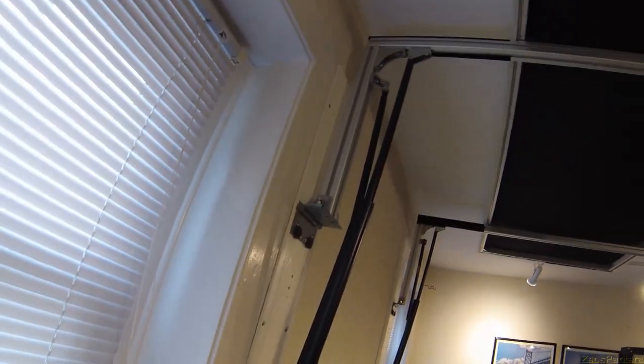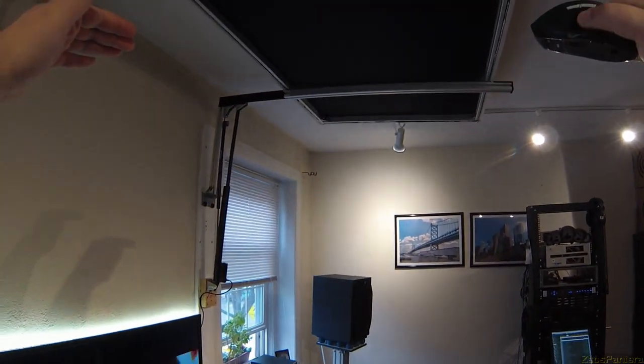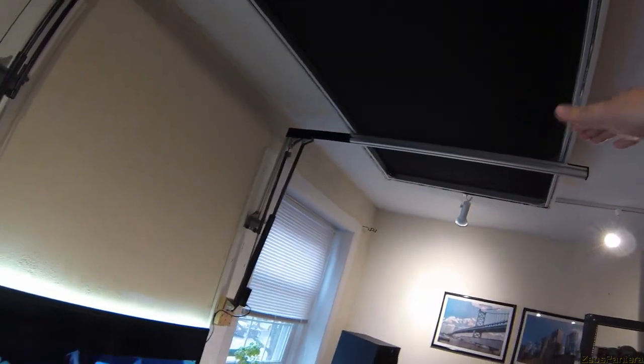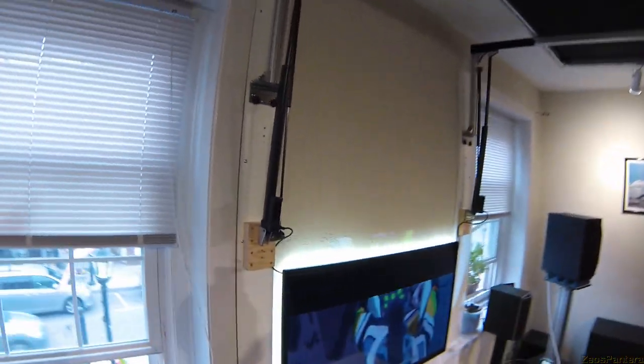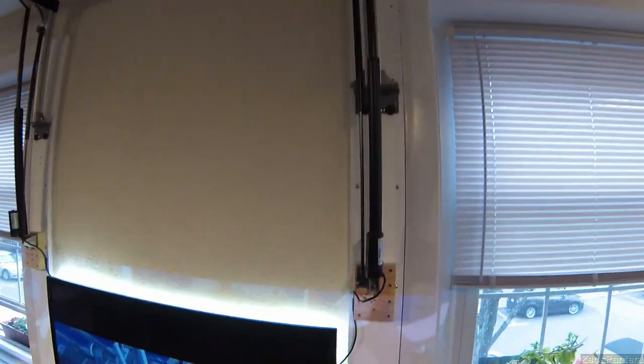The reason that the lift supports are here with the linear actuators is because the linear actuators would push up to this height, and then slowly it would fall, oh so slowly, till about here. And then if I jiggled it, no matter what was happening, the linear actuators would just start unwinding down. So they're cheap linear actuators, and they're very good. They just didn't have the strength to hold this sort of cantilevered load. So these 60-pound a piece assistants really just keep everything in line.